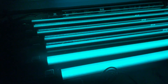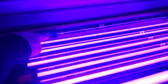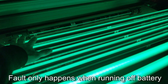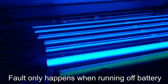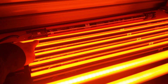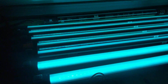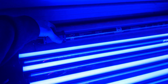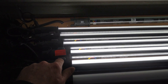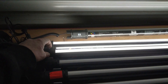What I've discovered is: if you have them in master and slave mode with the master turned on, and you start turning the tubes off, sometimes a pulse goes through to the other lights — they will literally pulse brighter, giving you a bit of a flicker. What can happen when you do that is one of the tubes just crashes and that's it. What I've discovered is, if you turn the master off first so these have all gone back to individual modes, when you turn the individual lights off — now they're not running in master and slave mode — you don't get a problem. That's the easy way around that.